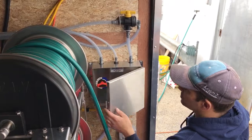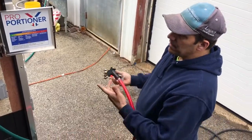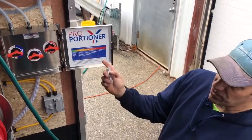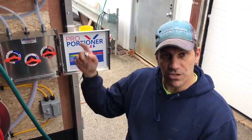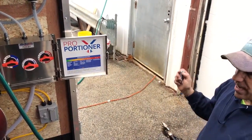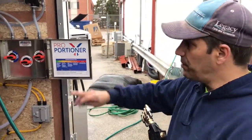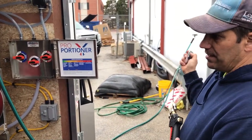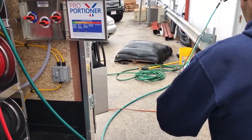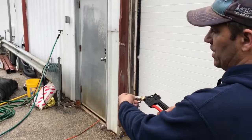So what I'm going to do is I'm going to open up my proportioner and we're going to get ready to start priming this. The first thing I'm going to do is turn my trigger gun on, open my water valve all the way. I'm going to hit the valve to switch it so it's going to directly feed into the booster pump. This is going to force feed the water directly into the booster pump when I hit the A button, and I'm going to turn it on. This is going to force the air out from the booster pump through the hose so that we can start priming the proportioner. You're going to see pretty quickly the water come out. Now there's been no water run through the system at all yet, so you see it's just air coming out.